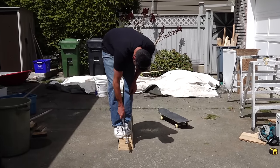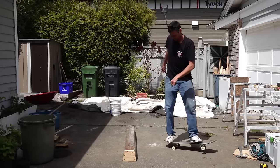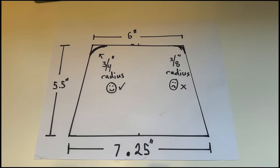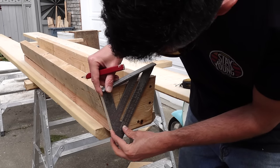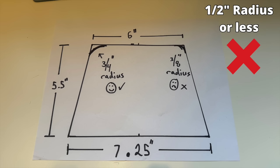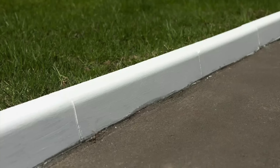The first thing I did was build a little wooden mock-up just to see if I had the proportions right, because I wanted to make sure I could do some popover tricks. In the end I made the dimensions a little too wide. It's about 7.25 inches at the bottom, 6 inches at the top, with a 10-degree slope on the edge. I think 10 degrees is okay, but you need to make the radius a little more — your average curb actually has about a two-inch radius, which is really round.